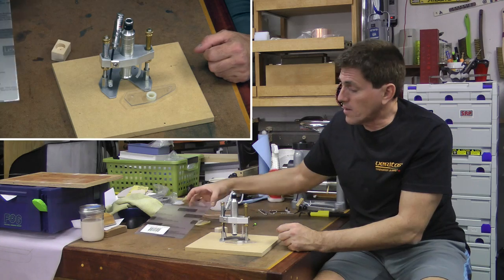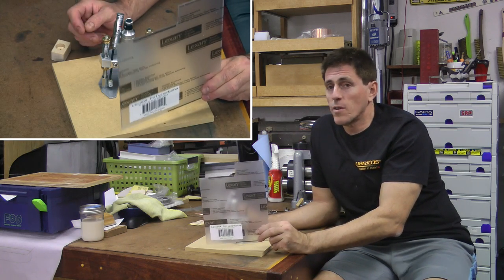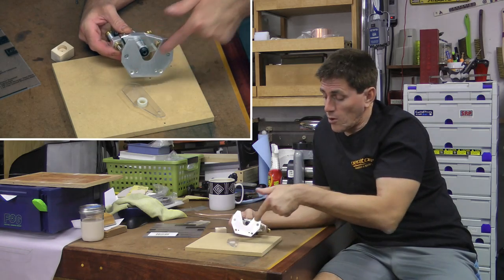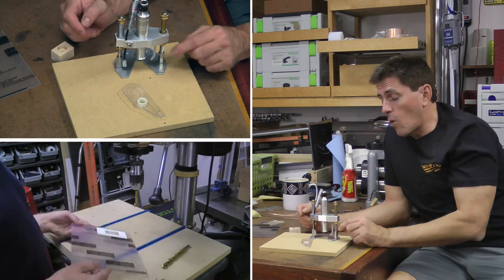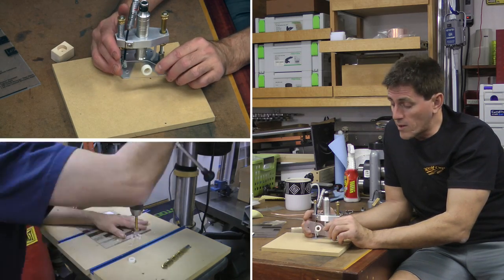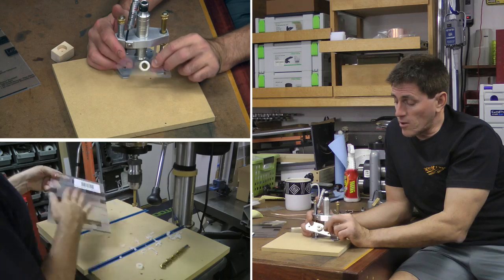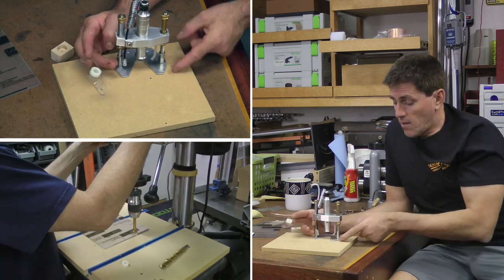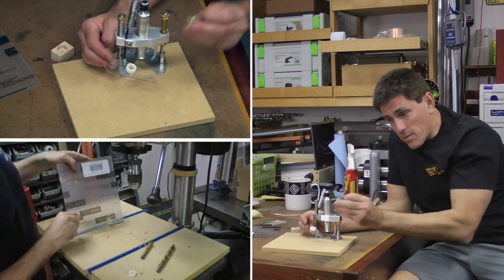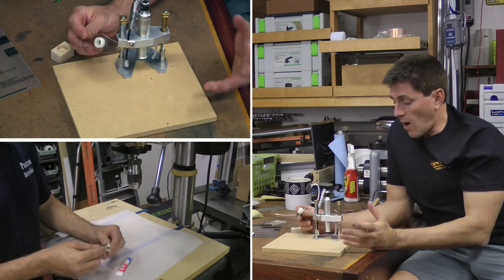So I started with a piece of Lexan, which is a polycarbonate you can get at any big-box store. It routes and machines very, very nicely — it doesn't melt nearly as quickly as acrylic, and acrylic tends to be shattery and brittle. I took a simple measurement from the bottom of the base, found the center of the blank, and drilled a three-quarter-inch diameter hole almost all the way through the polycarbonate. This was to seat a three-quarter-inch diameter nylon spacer, also from the big-box store. That spacer is a quarter inch tall, so once recessed, you end up with a little over an eighth of an inch projecting out — just enough to follow a pattern and leave room for the bits to clear. I also drilled a half-inch hole in the center to get the inner diameter clearance for the bits.